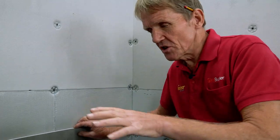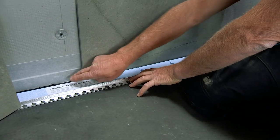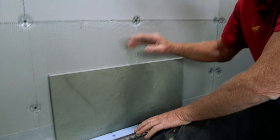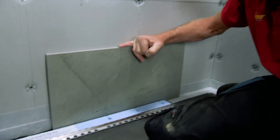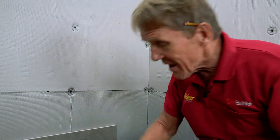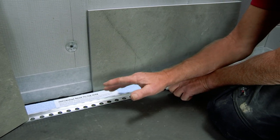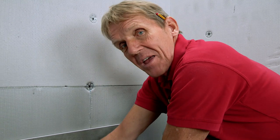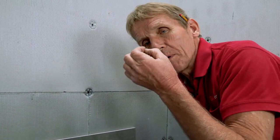One very important detail about this whole tray system: it's designed with a single fall going down to the linear drain, with no horizontal tiling behind the drain - all the water falls one way. So instead of tiling the tray first and then the wall, here you tile the wall first. It's slightly counterintuitive, but you want to get that tile down behind the drain, and then you can carry on with the floor tile into the tile trim. It actually says here 'important note to the tiler - put the tile trim in.' If you put that tile trim in and bring the tiles up to it, the job will be beautiful.